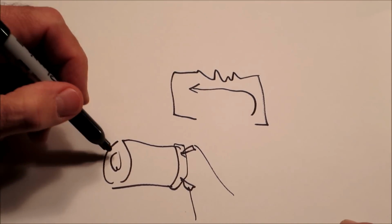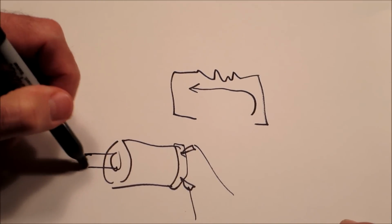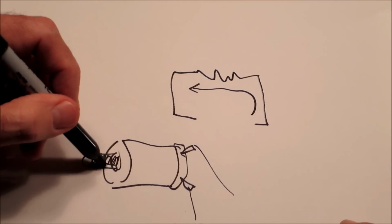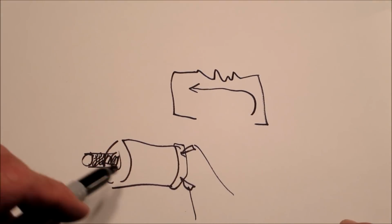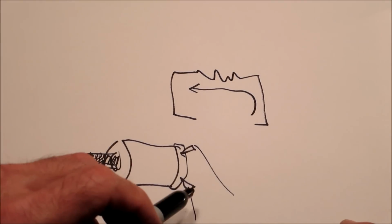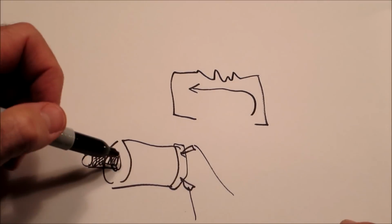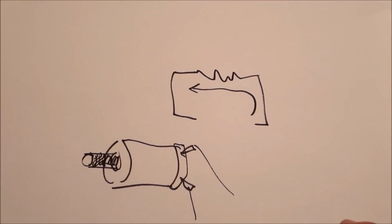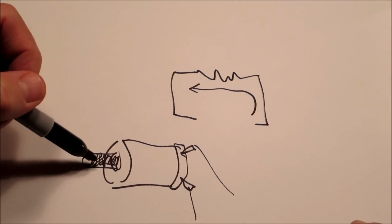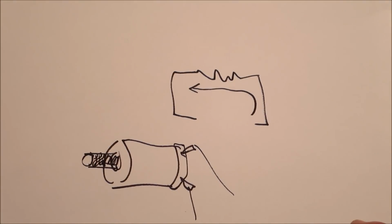And in every coil on a pinball machine, there is a plunger. When electricity is applied to the coil, it's going to push that plunger in the opposite direction. And then typically, when we release voltage, gravity will let that drop back down. That's what you see on a knocker. It would actually be turned this way, and the coil would fire and then just drop back down.